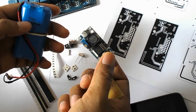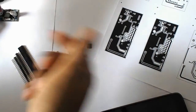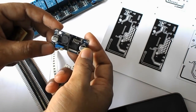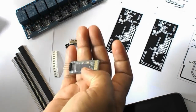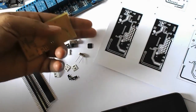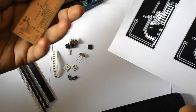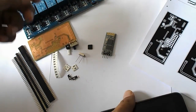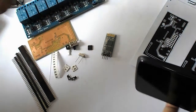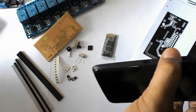To provide power to the whole board and microcontroller, I am going to use a battery and a buck converter. This buck converter will convert 7.4V to 5V to energize the whole project. This relay board works on 5V, so it is suitable. Using a buck converter makes it energy efficient compared to a voltage regulator IC. The board is designed in Eagle, the PCB printout was taken on a glossy sheet, and then developed by the toner transfer method. I will also develop an Android application using App Inventor to communicate with the relay board.